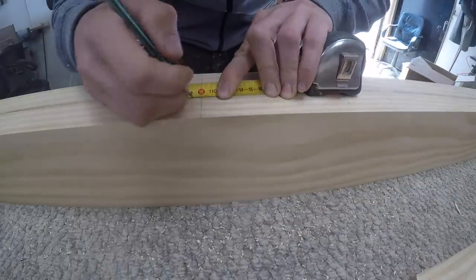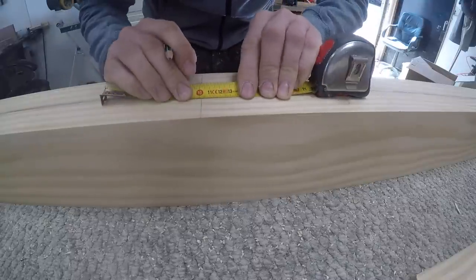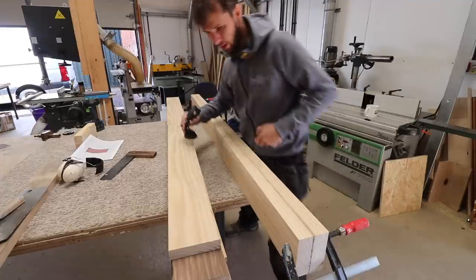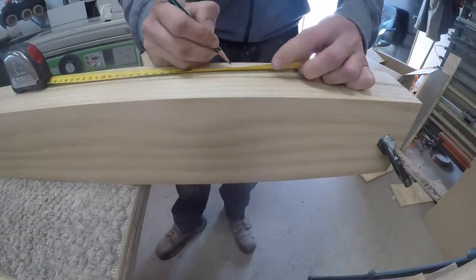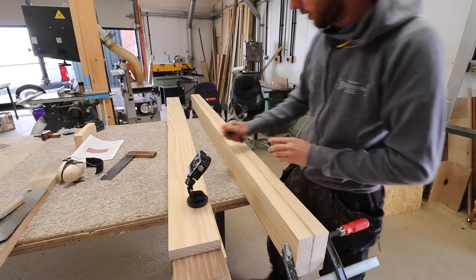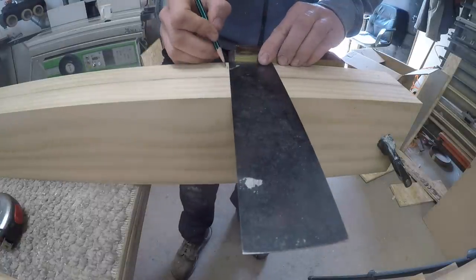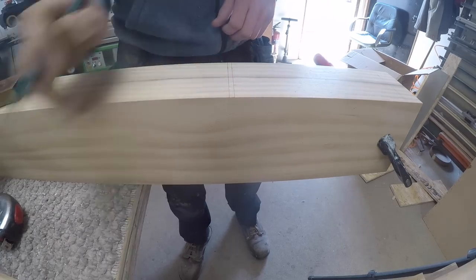It's got to be at least 5mm if the mortise is to be hidden, but go a little bit more if you wanted. But I normally work with a 5mm setback from the top of the rail. So that needs to happen on the middle rail and also the bottom rail as well. Mark it so you can see it. So 5mm, and we'll just square those lines over. So that's now the edge of our joint. That inside line there is where our joint will come up to.